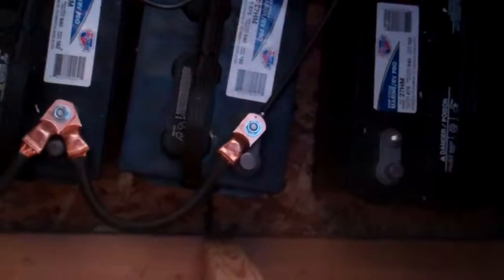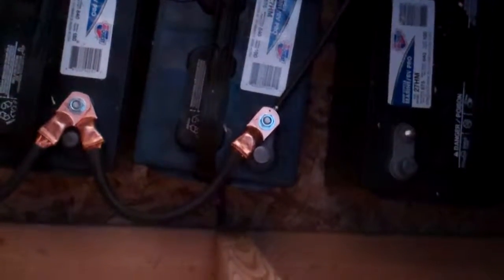What I did was I cut some 12/3 wire and spliced it — that's 12 gauge — so it goes from my batteries. Down here I've got seven 175 amp 12 volt marine deep cycle batteries, but just to test this I hooked three of them up.